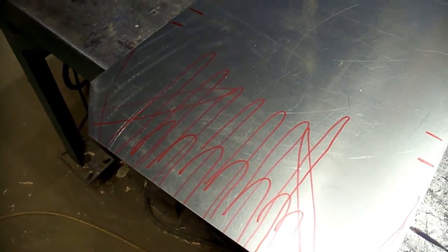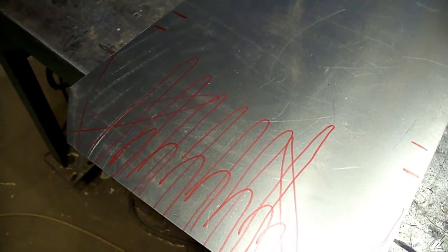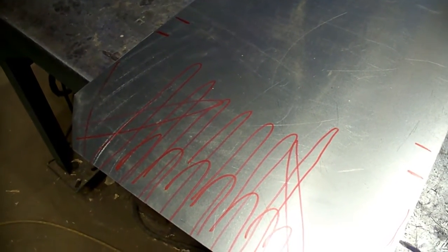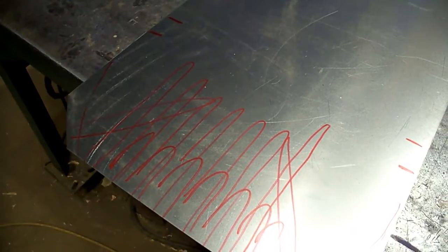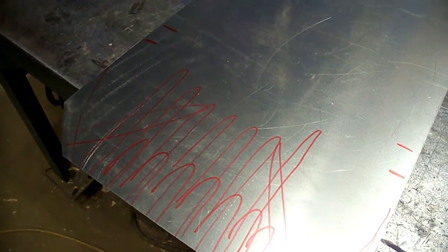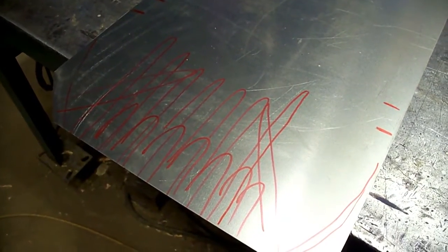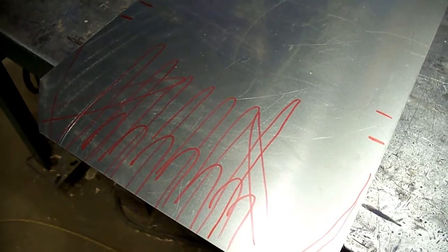And just like when we made the front corner, we'll shrink it, then we'll bring it over to the other side, we'll smooth it out and see what kind of development we have, and then bring it back and forth from shrinking to planishing and back and forth, and we'll wind up with a cab corner. Okay, we'll meet you over at the power hammer.